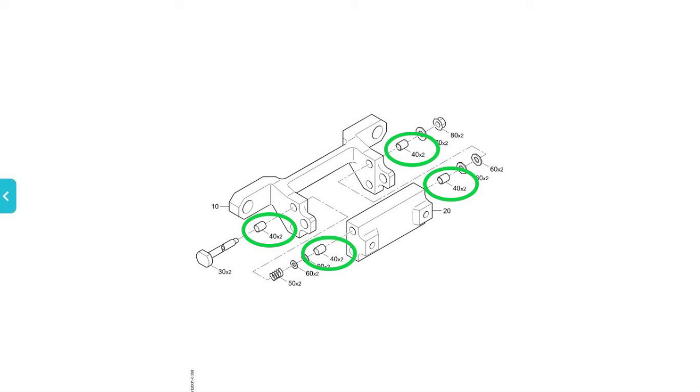And if it gets really sloppy, you're going to need to change those bushings, or change the slideway and the support. You can order the bushings. I just don't know how to change them. I've never done that job. I think we've just changed the support and the slideway. But if you take this thing apart, there's 2 through bolts and there's springs on the left side, which help push it away from the switch. There's 1 on each bolt and you could stack up these washers and add more washers to a certain point to add more pressure to the spring. Anyway, if you open this and take all this apart, expect springs to go flying and washers to go flying. Okay, so just a heads up and just be careful.